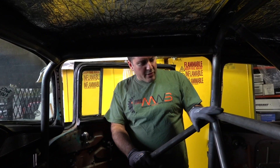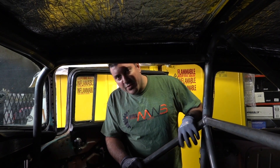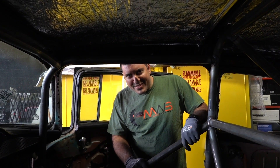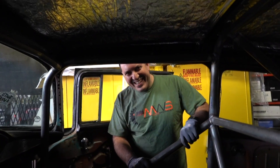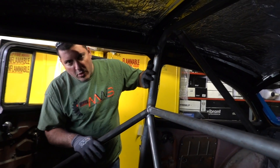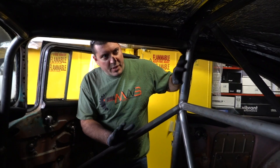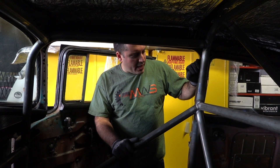Now Ed's going to talk about the layout of the cage. NHRA was just out here - my good buddy Pat put the sticker on here. The car's rated now for 850s. We hope to see this car go that fast. So this is your basic 850 cage. There's a main hoop. It's an Art Morrison cage - it was pre-bent, not notched - but super happy with how it fit and the layout of the cage.